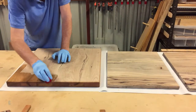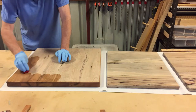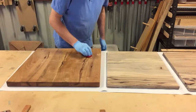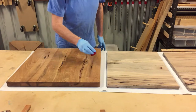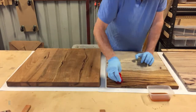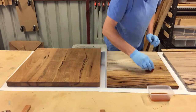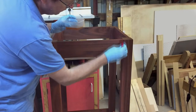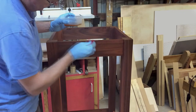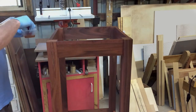The top and shelves were sanded to 240 grit prior to finishing. I wiped a couple of coats of Scandinavian oil onto both sides and the ends, using a circular motion to help push the oil into the pores, then wiped it off again to remove the excess. I sanded with 320 grit sandpaper between coats. I wiped on two coats of shellac onto the base to bring out the colour of the Jarrah, then wiped on a couple of coats of Scandinavian oil, again sanding with 320 grit between coats.